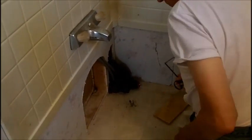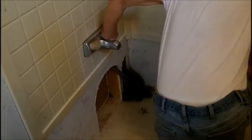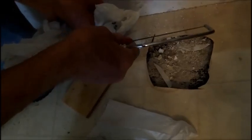All right. So we're going to go back outside and we're going to finish painting. Try to, anyways. Now here, I just stuffed bags in here. That's a big hole. Yeah, but that's 1/4-inch hardware cloth in here. I just swept all the crap in here from here. Okay, but there's cold air coming through here. So what we're going to do is, you see how they cut a hole for that? They just sloppily cut it. That's the way they do mobile homes. I've seen holes like that just for a little trap. So the 1/4-inch Luan will go over the top of this.